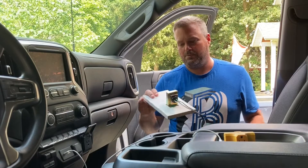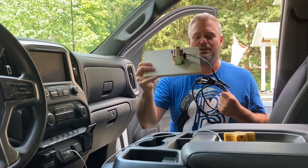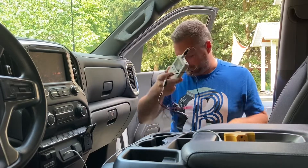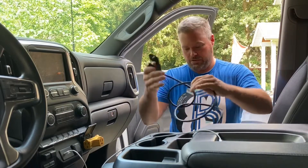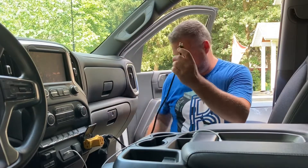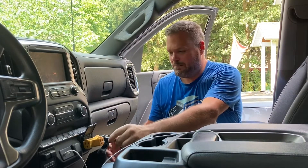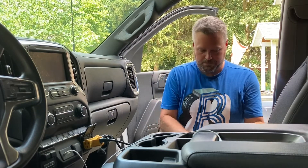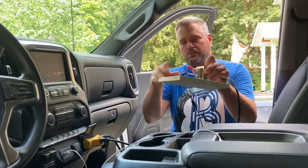I'll show you my setup: I've got my doorbell transformer mounted on a board with a plug to make it more accessible, along with my oscilloscope. First I'm going to put a doubler or tripler in the dash, plug in my doorbell transformer, then plug in a small load — the 100 watt light bulb — to see what the waveform looks like under load. Then I'll hook up my small oscilloscope, connected to the two pins on the doorbell transformer.